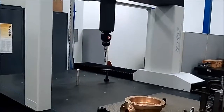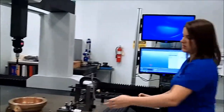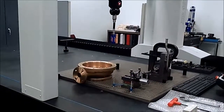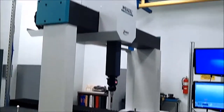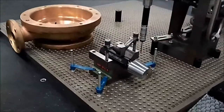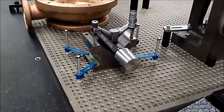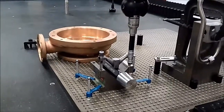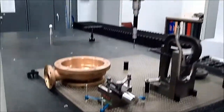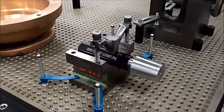What we're doing is coming down to the part and we're going to verify the taper. You come down and check a point, then move down a little farther, and you can take a bunch of different points here and it'll actually give you the shape of the part.